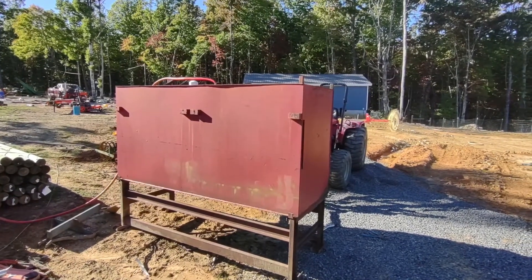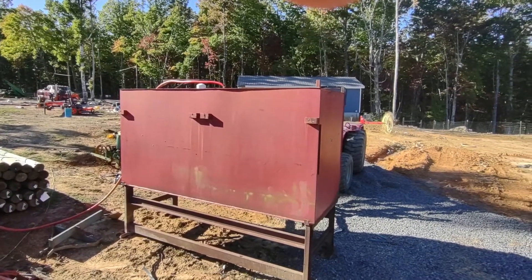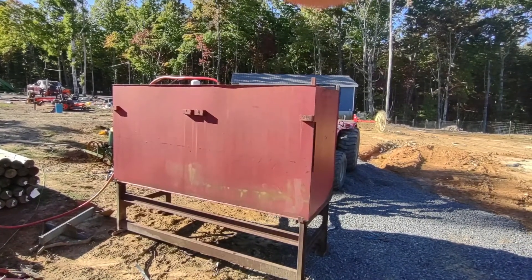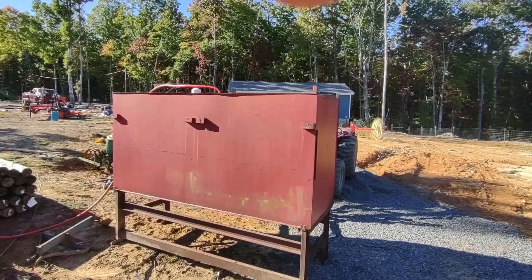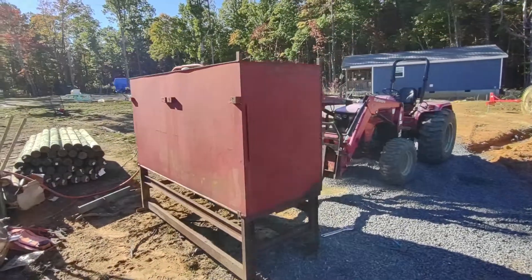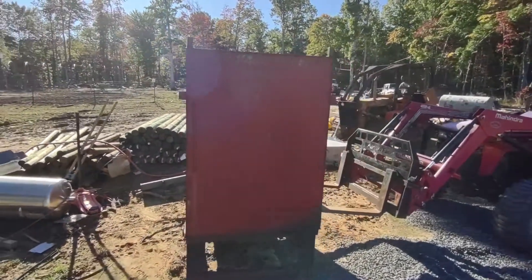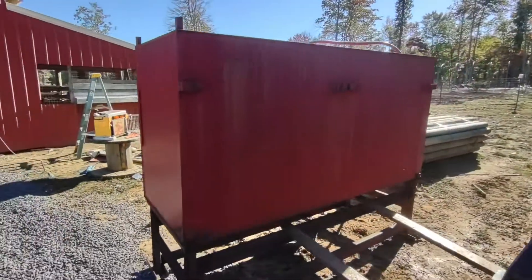What I'll do is fill it with water. Figuring that a three quarter inch hose puts out about 23 gallons a minute, it'll take a little over 30 minutes to fill this tank. Once it's full I'll let it sit for a while to make sure there are no leaks or seepage anywhere, then I'll drain it and let it air dry out.